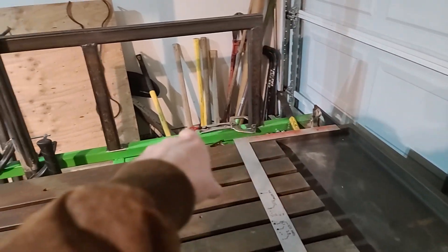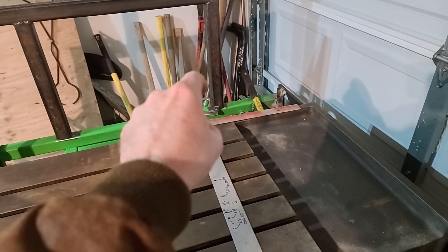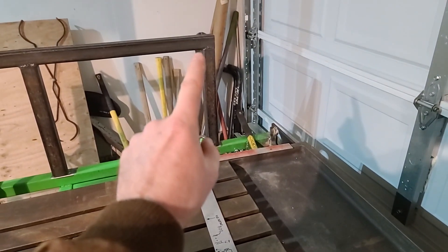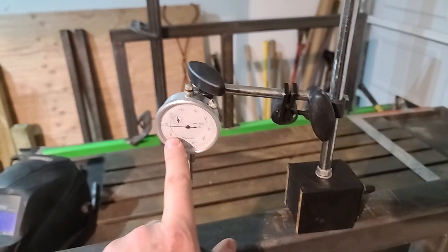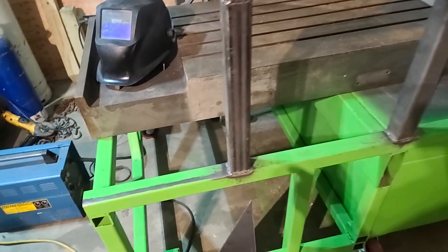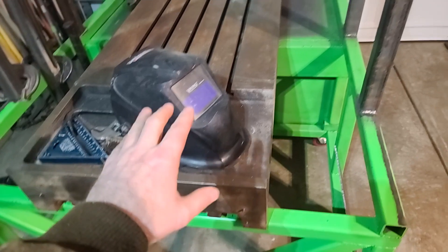The vertical adjustments can be done by not welding either of these before I weld on a piece of iron and a nut, through which I'll put a bolt to raise that corner up — because that's the low corner. I raise it up until this gauge shows exactly the same as the other end, really simple. I no longer need the hoist in the shop because at this point I can just use the floor jack to raise this up if I need to shim it and perfect the table leveling.